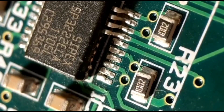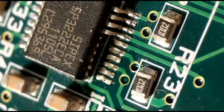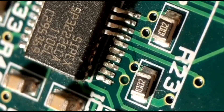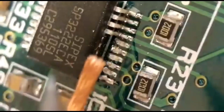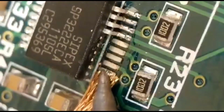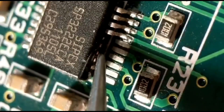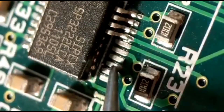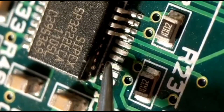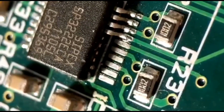I'm just going to gently wick off the remains of the solder there. The main thing is just take your time — gently ease off the damaged parts and clean up the pads. All the pads are still there, which is a good thing. You've got a little bit of copper coming out of the body on all six positions: one, two, three, four, five, six. We'll do three one way, three another — a simple wire link for three of them, and legs taken off another old IC for the other three.